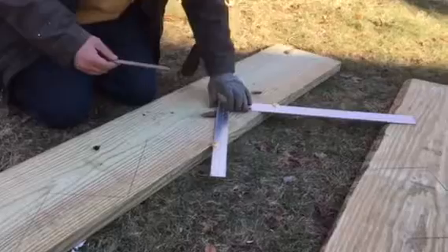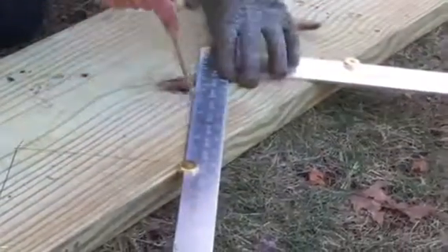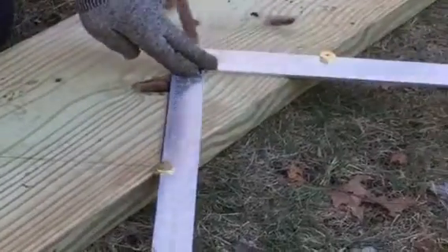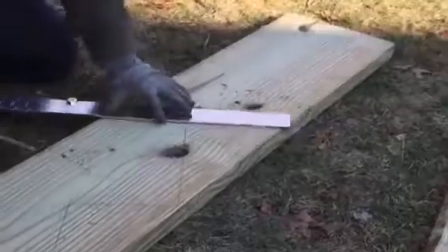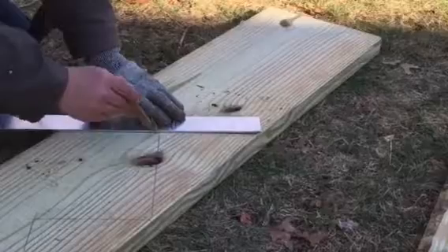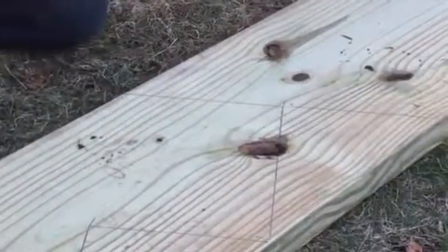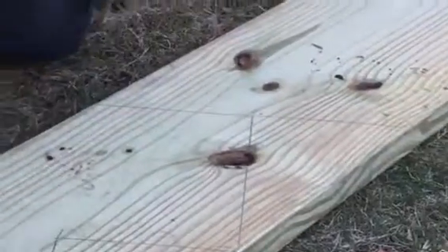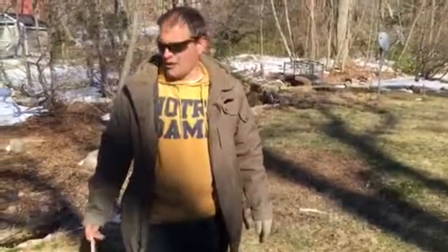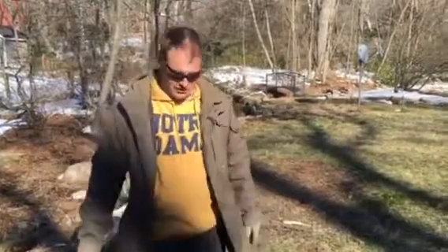So this is my last one. I'm actually just going to extend this line — just like that. This is what's actually going to mount up against the deck. I'm going to cut out the same notch that's right there. So there you go — two different ways to make your stringers. The tracing method is obviously much faster, but if you don't have the old stringer and you're building a new deck, then this is what you've got to do.